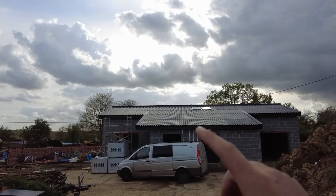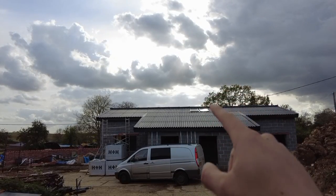We did try to do it before - me and Dan did our own loft conversion. One of the very few things we didn't do ourselves was the Veluxes. We got someone in who was accredited and said we want it done with splays. He didn't do it with splays, he didn't do it properly. On the previous conversion we had counter battens - big 50 mil chunky stuff - that's where the actual windows sat, so that was okay. However, on a lot of stuff you don't have counter battens, and Velux, Keylite and all the window companies - their instructions all have counter battens. So I spent almost all morning figuring this out.